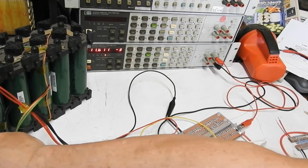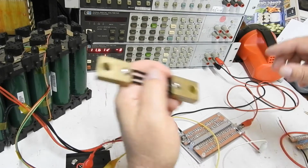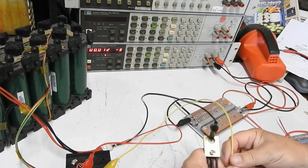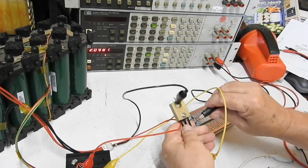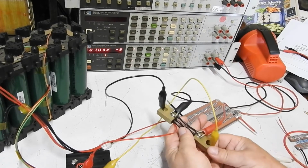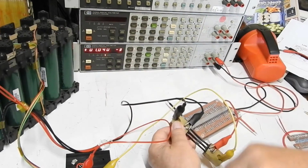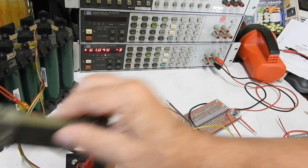And if we take, say, this shunt, which is 100 amps, 100 millivolts, so that should be 1 milliohm. So I'll just stick the current, I don't need this second clip lead anymore, just stick the current into there and put the meter across the sense terminals. And this should be 1 milliohm. And that's pretty close. 1.02-ish milliohms. Hope that's visible, is it? 1.02. Okay.